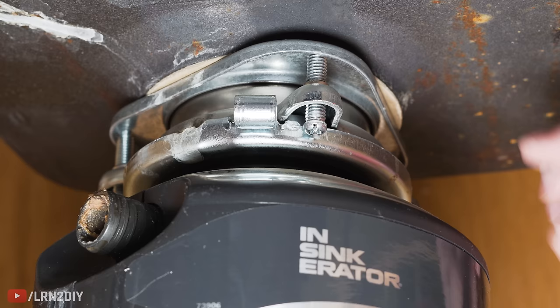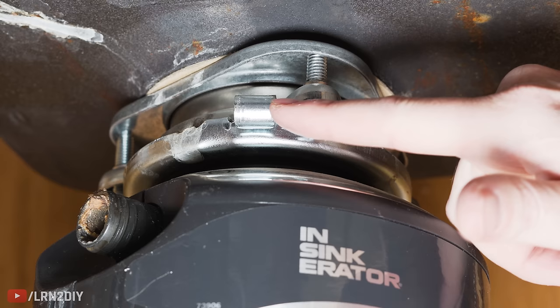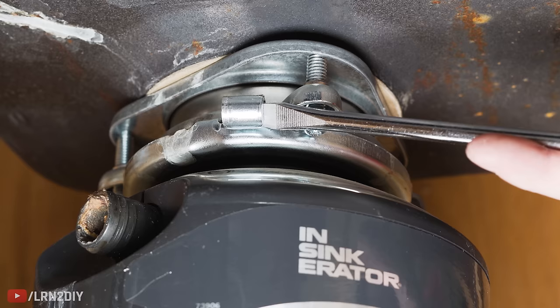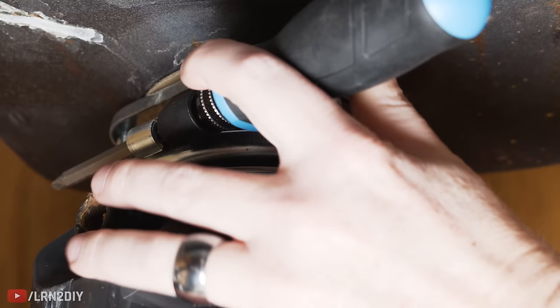Every setup is going to be a little different, but this is a very common setup where you have a couple of flanges connected to the sink and then a quick connect that tightens right onto the flange system. We need to loosen this ring — it's got hooks for screwdrivers so you can get more leverage. Push away until you can fit a screwdriver in there, then start to turn it. Be aware this is heavy and it's going to want to fall, so that's why we have the support system underneath. And off it goes.